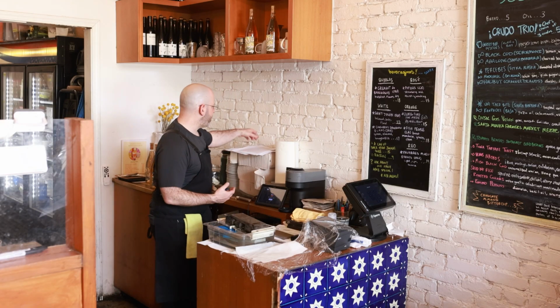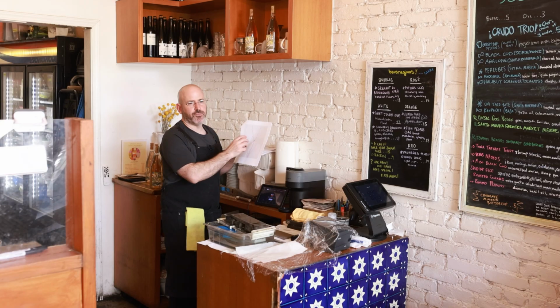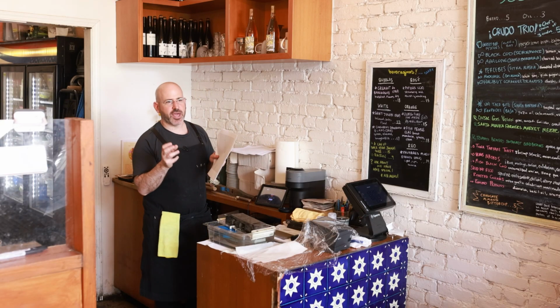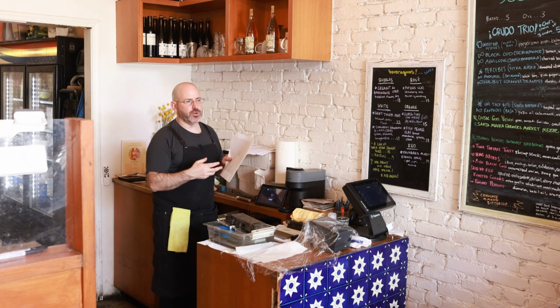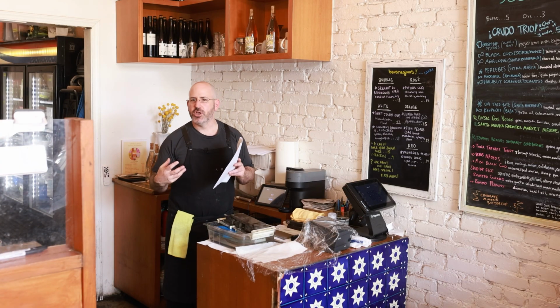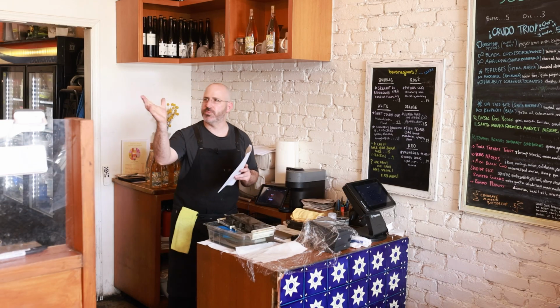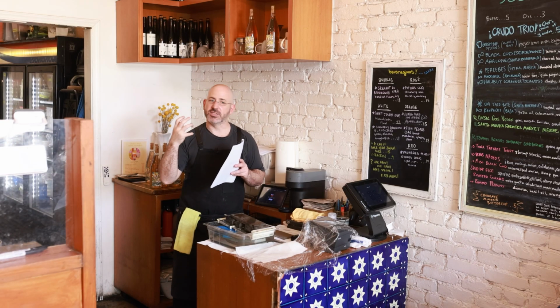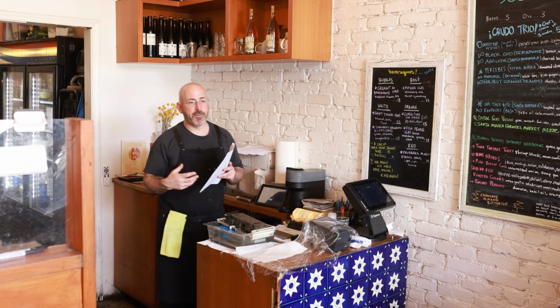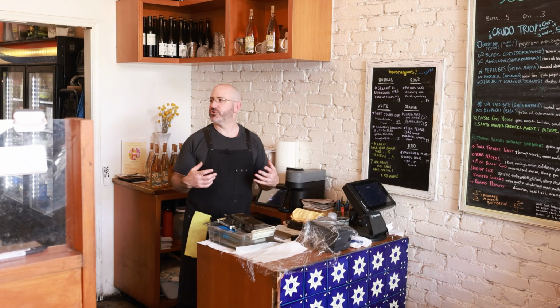And a micro bevel is what I show here at the very last little bit of this edge. And you'll see that the distance from 3 to 4 is a less acute angle than the rest of the bevel there. What a micro bevel is, it's removing the last little bit of the edge, that's the weakest part of the edge, and replacing it with something that's a little bit more durable. So you sacrifice a little bit in maximum potential sharpness in favor of something that's not going to chip as much and that's going to stay sharp a little bit longer. Micro bevels work really well to preserve cross-sectional geometry on things that are really thin or minimize chipping on things that are really hard.